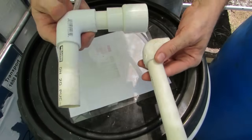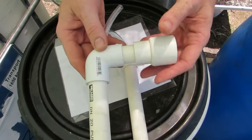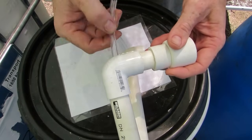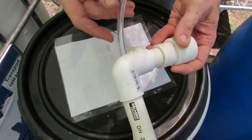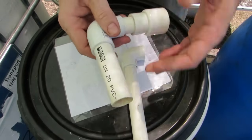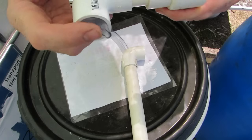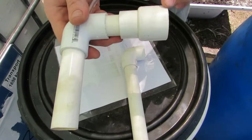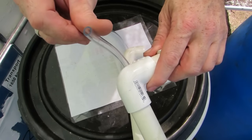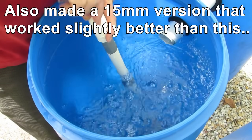I'm sold on this design. The next one — I've made two of these — is a very basic venturi I've seen online quite a bit. What you have is your pump coming through a one-inch fitting down to a three-quarter inch, with a little bit of hose — some people use biro pens. All I've done is drill a hole a little bit smaller than the hose to make it fairly tight, and just push some hose length down into there. The sweet spot is just below the edge of the fitting, and there's a little bit of a bevel on the end.